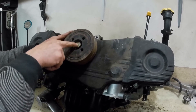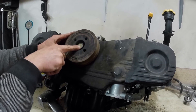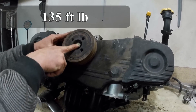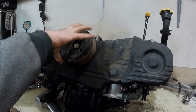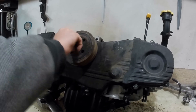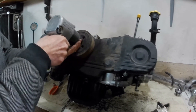The torque on this bolt is 135 pounds. Make sure it is torqued down properly — having this back out can cause the pulley to start to come loose, and if the pulley starts slopping around in there it can also destroy that keyway as well. Definitely something to be careful of.